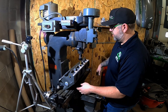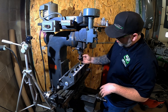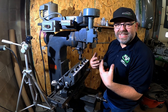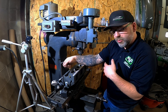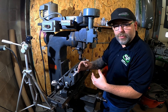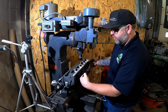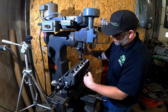With the intake up and supported and clamped, we're going to take some time to make sure everything is right. We'll drop our end mill out and use our dial indicator to indicate in on the edge and make sure it is square. We also need to set our angle at the same time — if we get it square and then loosen everything to add shim stock, we can lose our zero. So it's a doing-two-things-at-once situation: get the angle correct on the back side, tip it over where we want it, and get everything squared side to side so all our injectors are in a nice straight line.